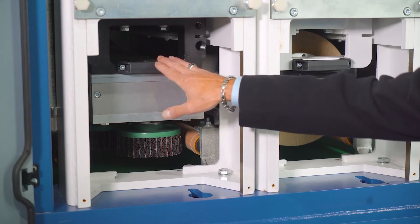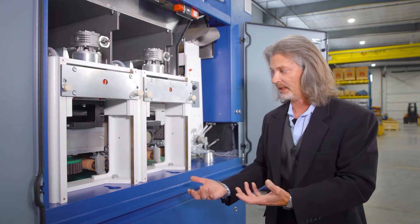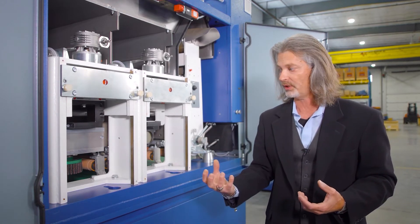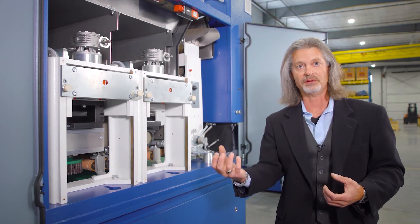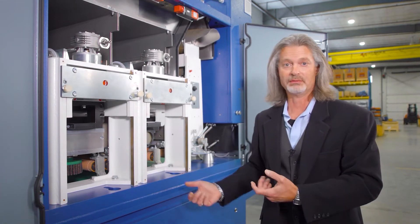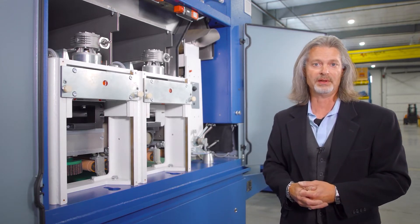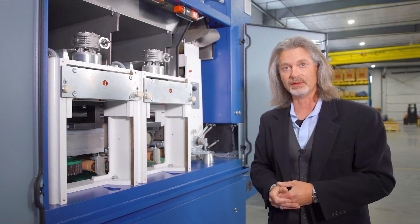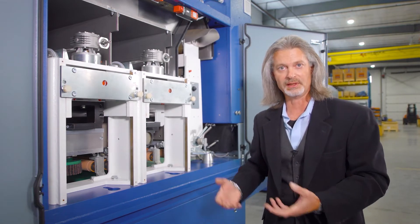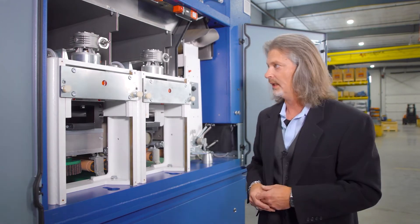This is a style of brush called a top brush. You can put different types of media on that platform by taking out each brush — there's one bolt holding each brush — and replacing it with a different type of material, such as stainless steel wire, ceramic, or a non-woven material with a coated abrasive in between. That's the most popular configuration because you want to be able to do multiple materials in a wet machine, so you want a brush that can be as versatile as possible.